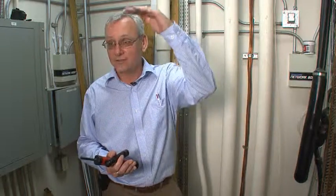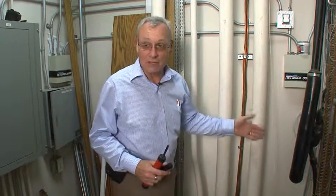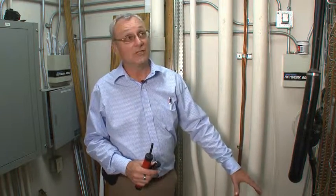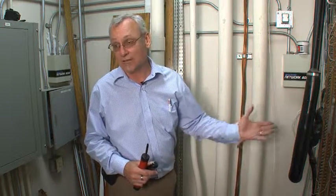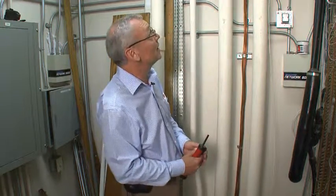We're in a typical electrical room — in most buildings these are stacked one on each floor above each other, mimicking floor to floor. In a room like this we see a lot of pipe and conduit penetrations. These areas have to be sealed and fire-stopped, and none of them here are fire-stopped. There was some attempt at the top to seal around with one-part foam, but that's not a fire-stop material.